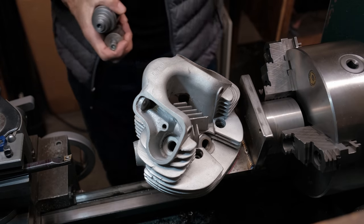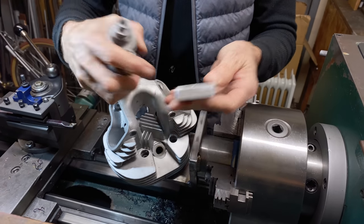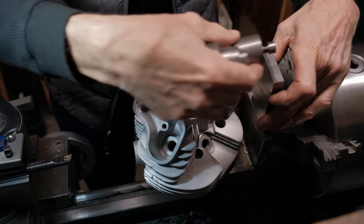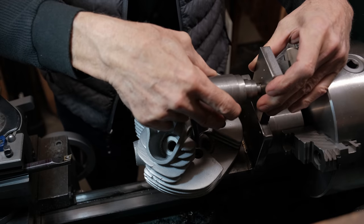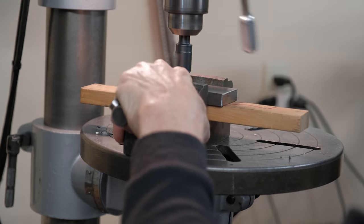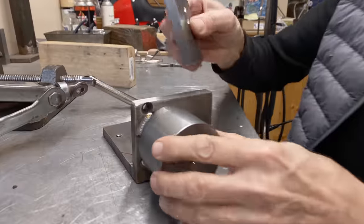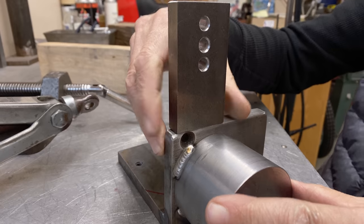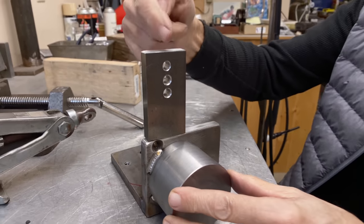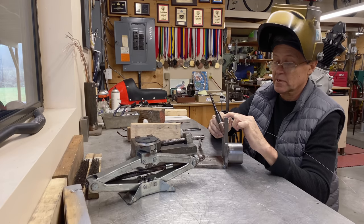I took a piece of half-inch flat bar with three holes marked — not drilled yet — and that is going to get welded on there. I've got some metal here and I can bolt it on and change the position of the holes. We're just going to experiment and see what happens. This is all offset from center, so I'm putting this over and welding it right there — it's offset this way to offset the offset on the other side. I'll tack it, then put my gloves on.